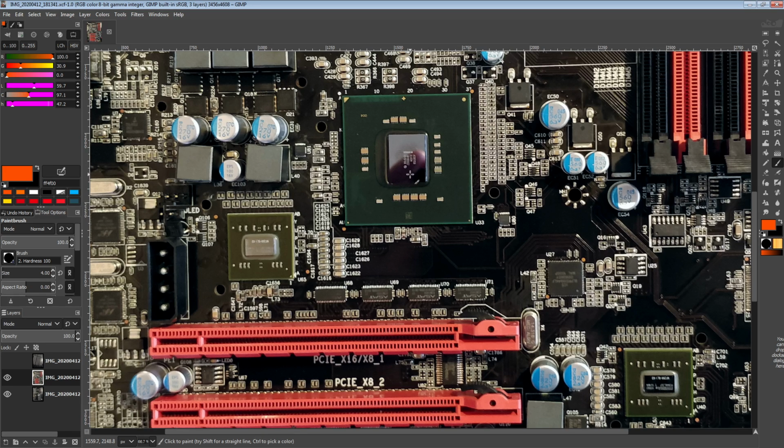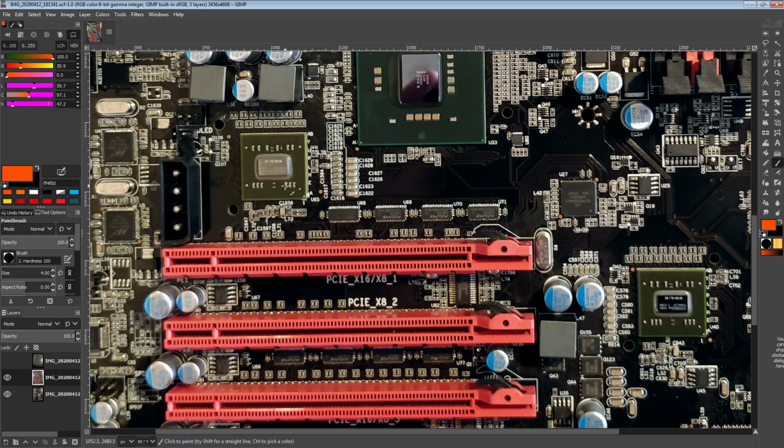But back in the day, NVIDIA still made NF200s. So if you wanted a quad SLI license, you needed to pay for a pair of NF200s as well as the quad SLI license. Because, well, actually, you need to pay for an SLI license just in general. That's just a thing that NVIDIA sells because they're NVIDIA and they couldn't help themselves if they didn't charge you for things. And then the NF200s is just an extension of that where, technically, quad SLI doesn't need a pair of NF200s, as you would know if you've run a Z77 motherboard with quad SLI support, or I think even Z68 boards with quad SLI don't bother with the NF200s.